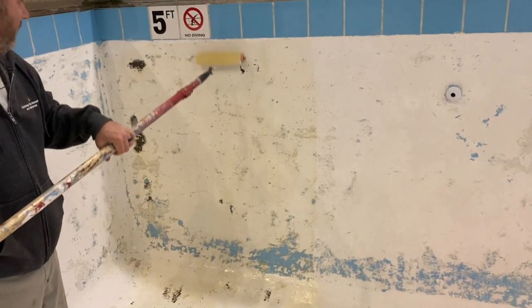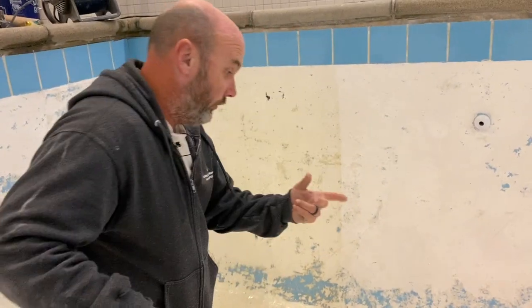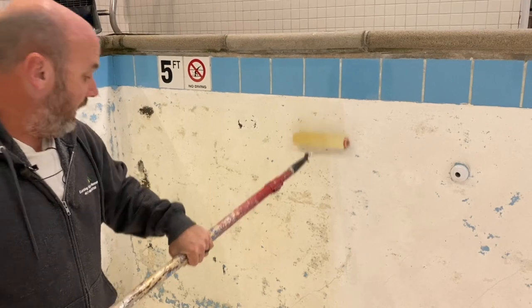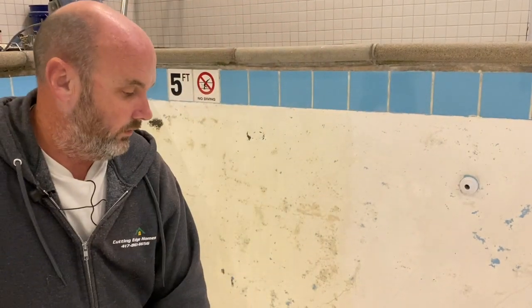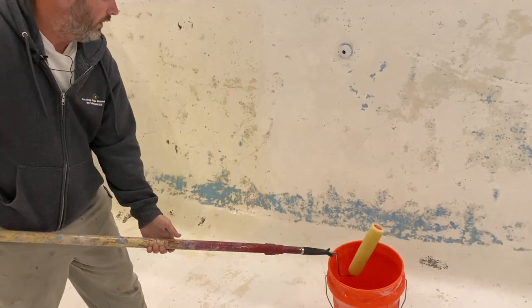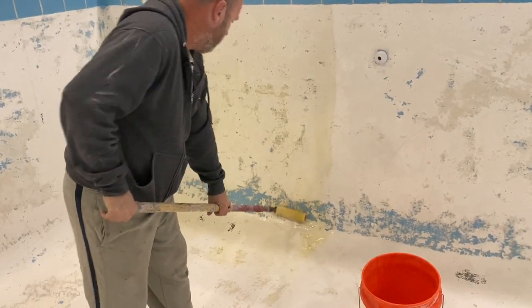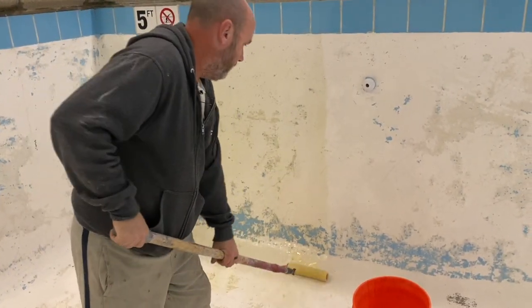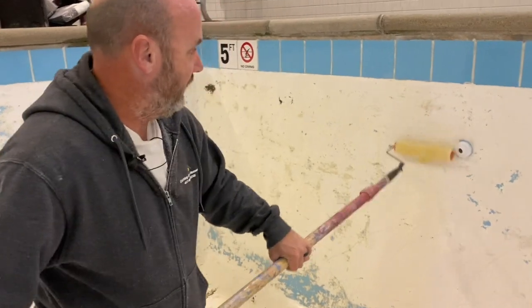And before it gets outside of its cure time, we will chemically and mechanically bond a full strength coat with no acetone on in the morning. That coat will build on top and flatten out and be really smooth. Then, while it's still fairly tacky, we'll start our Ecofinish, which is the thermoplastic powder coat that melts into the epoxy. After that first coat, we're pretty much done physically. The next coat is simply to make it real even and beautiful. It's just beautification, it's all it is.